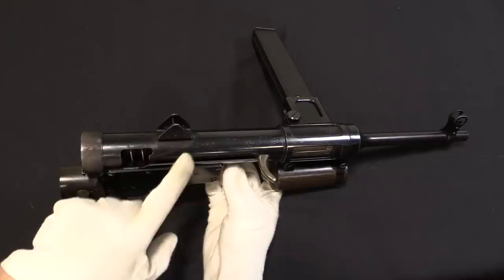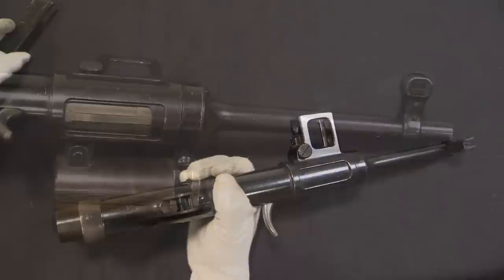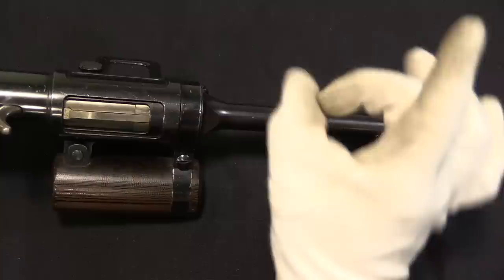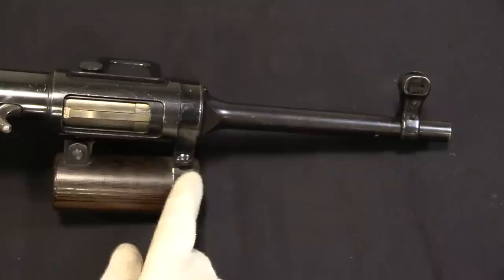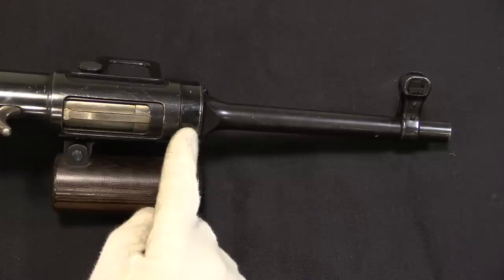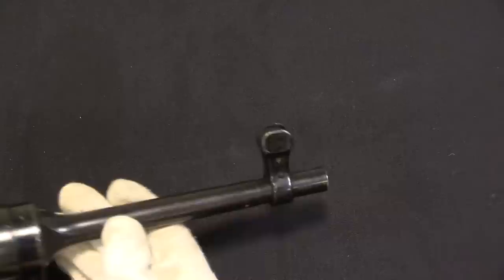This is the very first one, and there are a couple of interesting things. It was built on what was originally a very early Lanchester receiver, too early to be in the production. It uses standard Sten magazines — all three of these do in fact. The barrel has actually been flipped around back to front. On the original Lanchester barrels there was a section at the front with a big full-diameter flange, and the whole barrel threaded into place. That was flipped around, and that threaded section was used to thread into the front of the receiver. A new chamber was cut, and the end of the barrel was cut down just enough to get rid of the original cut chamber.